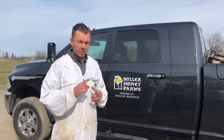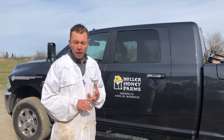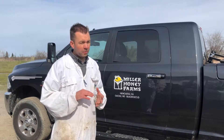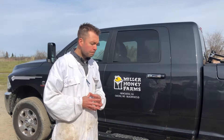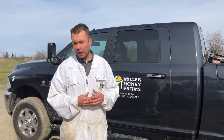Lately I've been experimenting with electric pumps. Can we find something that has the pressure and the capacity — the gallons per minute required — to pump syrup, particularly when that syrup is cold, or if you're wanting to pump something a little bit thicker like high fructose corn syrup? We typically purchase sucrose at only 66% solids, so it's a much thinner blend and pumps a lot nicer. But a lot of people like to buy the high fructose corn syrup blends, which are typically thicker with a higher percent of solids.